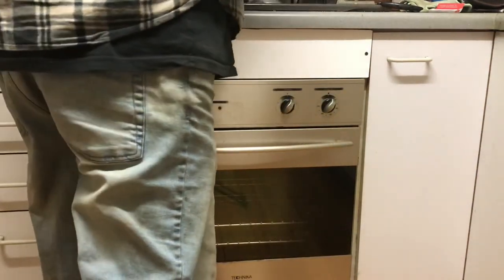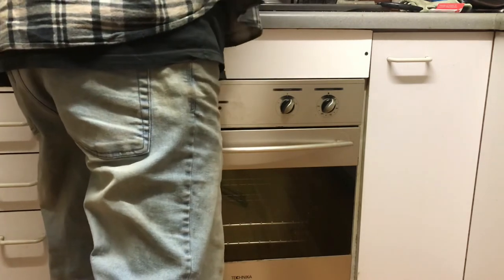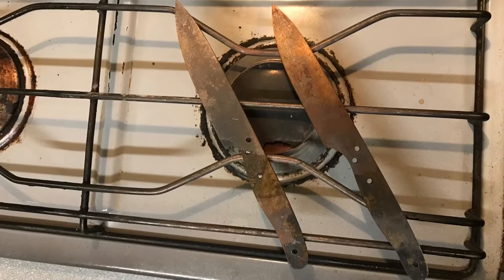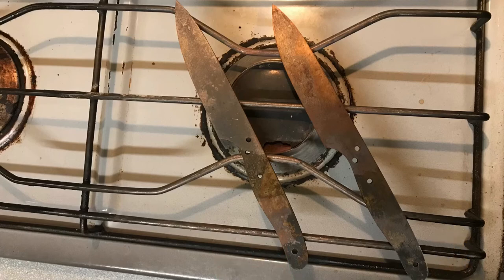The second temper is completed — back out of the oven we come and they are all good to go. We just let them come back down to room temperature and they'll be right for me to grind tomorrow. There they are, all heat treated and tempered, ready for grinding. That is our next step — grinding the bevels into the knives. Thank you very much everyone for watching. Please hit like, subscribe, and hit that little bell notification so you know when the next video comes out.